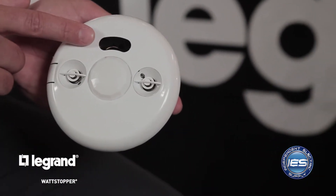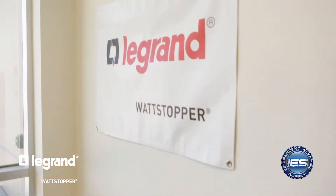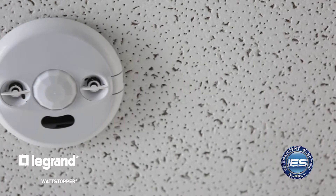Ultrasonic is great for minor movement and it really fills up the space. It's a volumetric sound wave — that sound wave leaves the sensor and bounces off the floor and wall, returning to the sensor at a constant rate. Because you or I move throughout the space, that sound wave hits us and takes longer to return to the sensor, signifying someone's there. A cubicle office environment or maybe a stalled restroom — great for ultrasonic. So no nuisance of lights going off during the day.